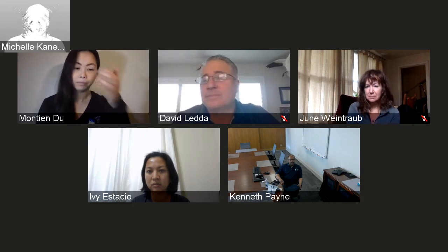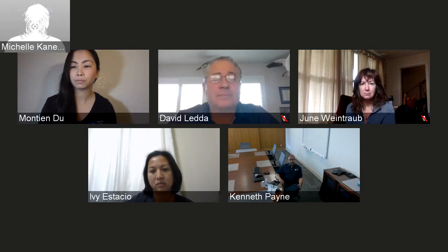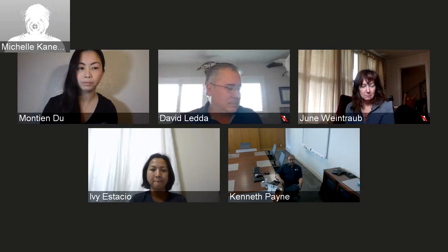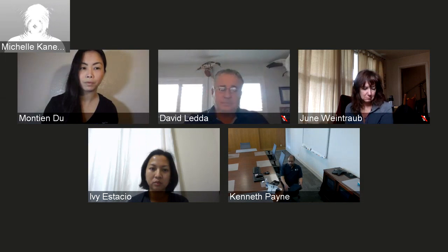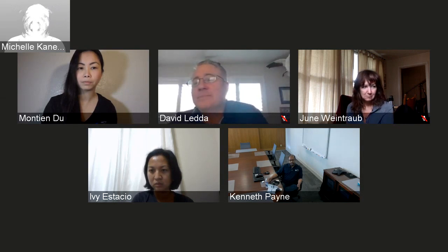Hopefully I answered that, because I think that question came up before, while Montienne was talking. But the violation list should be in the drop-down menu. Such things as if the assembly is rotated, whether it's the body of the assembly or the shutoff valves, would be considered a violation. Also incorrect orientation, like in the example of when it was in a vertical down position, when it was only approved in the horizontal and vertical up position. Also if it's the wrong type of assembly, inadequate protection, an unapproved assembly that's not on the USC list, or modified assemblies, which could mean a variety of different things, and I can't go through every single one. But if the assembly has been modified in any way, that invalidates the approval.